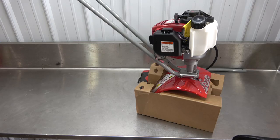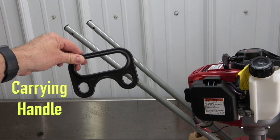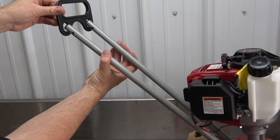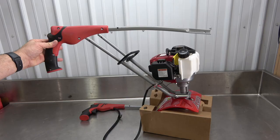Make sure both nuts are equally tight. The upper handles can now be installed. Begin by installing the carrying handle. Lightly squeeze the lower handles towards one another, so they line up with the two smaller holes on the carrying handle. Then, slide the carrying handle on in this manner.